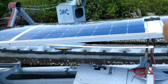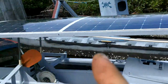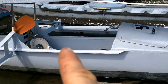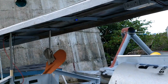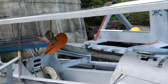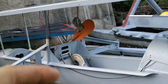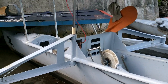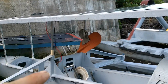Alright, so instead of all my wires going into the charge controller, which is right up there, these two are going to come down here and go through a switch that I can reach when I'm sitting. Alright, voltage is up to 26.9. That's good. I don't know if you can see it from there. Take my word for it. And I've got two solar panels running through a little switch right in there. Too late in the day to test it. The sun's almost down. And I'm going to get a third solar panel with a wire running down to that switch.